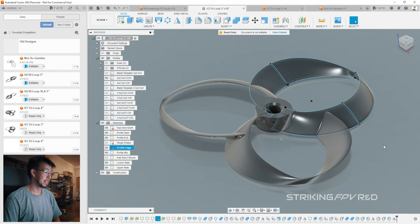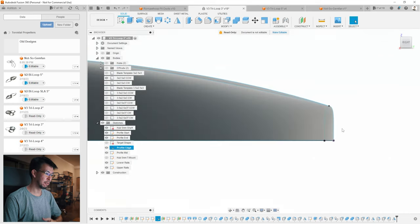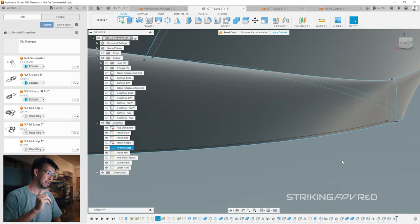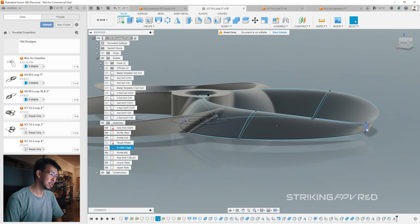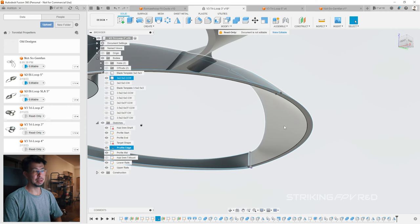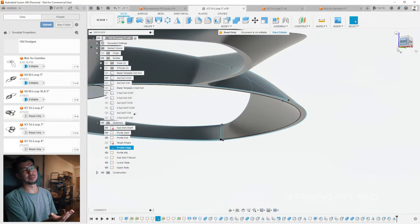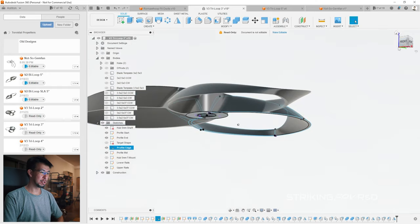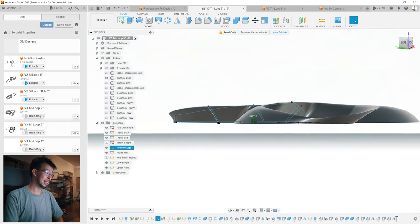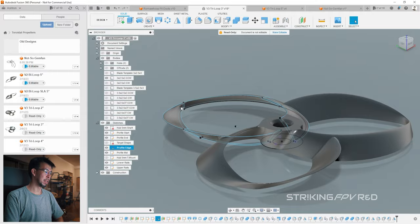Now, I'm very happy to say that this is what I've put great effort into for the latest design, because whilst the previous designs used to have quite a tall edge kind of profile over here, I've shortened it. And the benefit of doing this, not only does it reduce weight at the edge, which should help improve prop response, but the other reason for doing it is that it helps to keep that blade angle just under here, if you can see the mouse, getting shallower and shallower and shallower until the last moment where it has to become upright. Nothing we can really do about that before transitioning to the forward edge, where the exact same thing applies, where the angle becomes as shallow as it can the further out you go, but eventually becomes completely vertical.